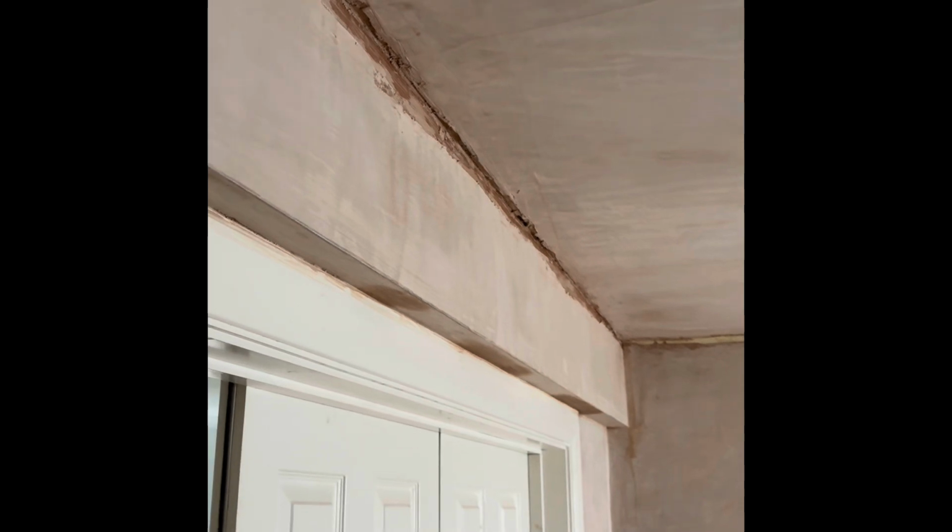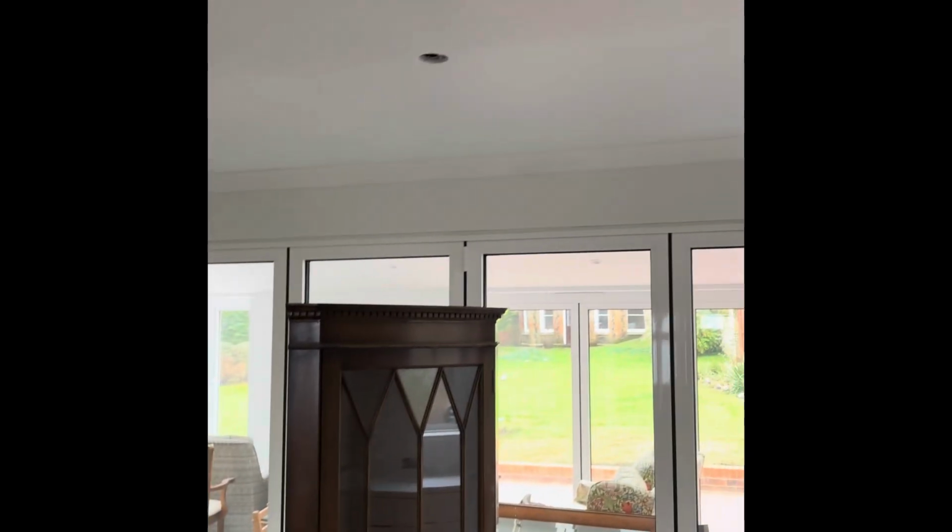So yeah, it could be just a nice Friday really, nothing too strenuous. And get this coving on, because it looks terrible without the coving on with them edges all left. Looks like a right bodge. Anyway, the coving makes it look good. Exactly the same as what happened in here. Did the same and then coved it. I would have preferred them to use the 127mm coving, the deeper one really, but this is what they wanted. I think it just looks better, the deeper one, especially in a room this big. You can afford to go a bit bigger with your covings in a room this big.